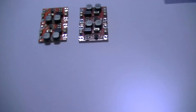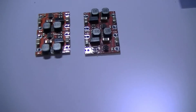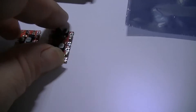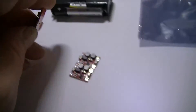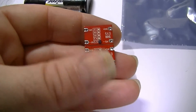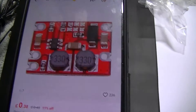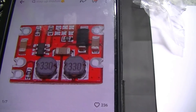The second board in this build will be one of these DC-to-DC boost converters. These are great — you can use like two AA batteries which will equal about 3 volts, and one of these will boost up to 5 volts. I'm going to use the 5-volt setting because you seem to get a higher audio output with 5 volts — it's louder simply. And these are extremely cheap as well — 38 pence, about 50 cents. We're going to power it from two AA batteries, boost up to 5 volts.